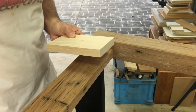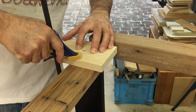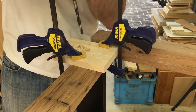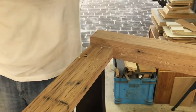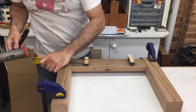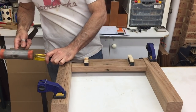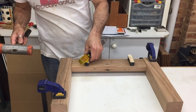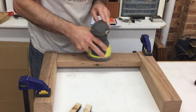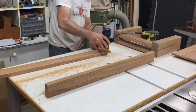The problem I had now was I had to drill out those dowel plugs very accurately so I could reuse the holes. I drilled a hole in a piece of offcut using the same drill bit to drill out the dowels and used it as a guide, which worked perfectly. After cutting the frame out I used a chisel to gently pry apart those glue joints, which actually turned out easier and cleaner than I anticipated. The new stretchers are thicker than the old subframe timbers so any marks will be covered over. And like the rest of the base, I removed the sharp corners on the stretchers with a 45 degree chamfer bit.